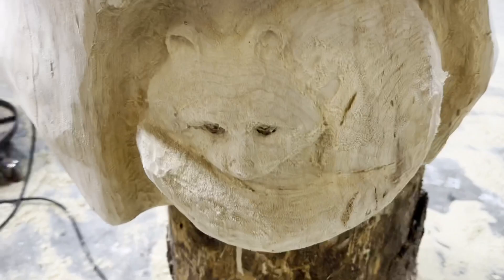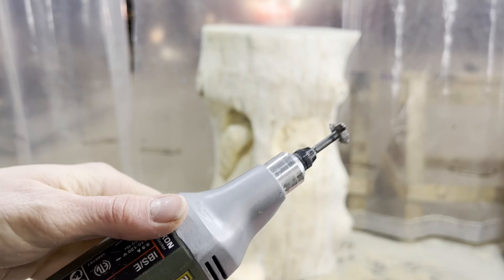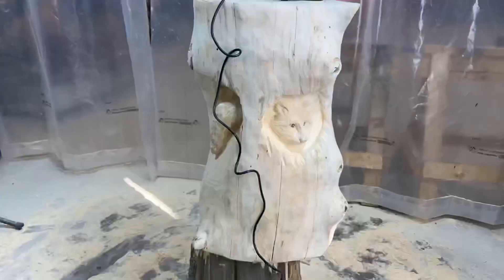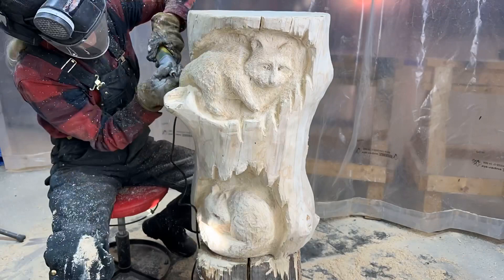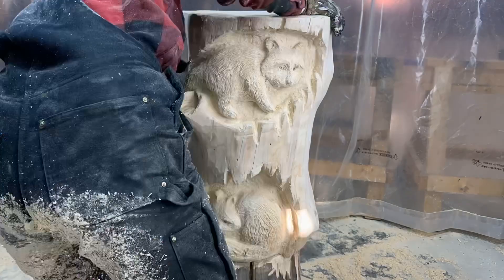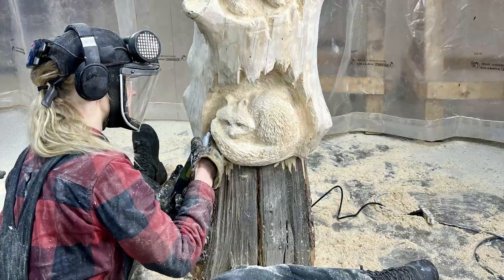The next smallest tool I use is my Proxxon Rotary Tool with a mini carving bit by Mampa Tools — it has triangle-shaped cutters and works awesome for creating fur texture. I like to sketch out the fur direction and flow with a pencil first and then carve it. Generally, the fur flows away from the center line of the animal and downwards to wick away water. I use a lighter touch and shorter lines around the fine fur of the face, and heavier longer carving lines through the thicker fur. The body is a medium fur texture.